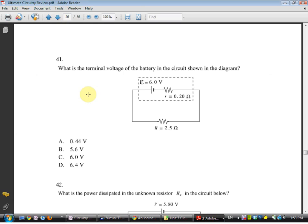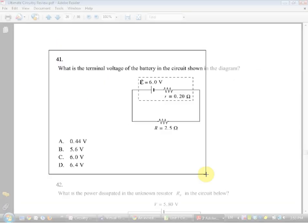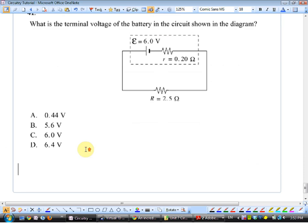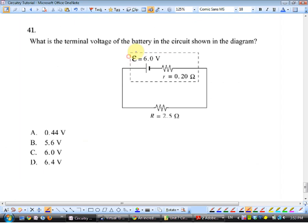Hey, Savannah. Terminal voltage. Woohoo! Savannah, on the circuit diagram, terminal voltage is this minus whatever voltage through there. That's terminal voltage. And that's probably how I'm going to end up finding it. Let's see. Have they told me the total current? Have they told me anywhere with 2? Gonna have to say total current is gonna be total voltage divided by total resistance.